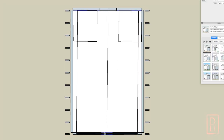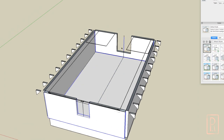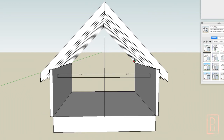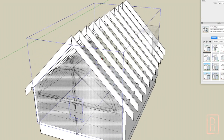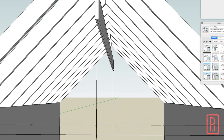You can see the door is here, the window is here — this is a plan view. Here's a line going right through the center of both. You can see that this line is not parallel with the side walls. So this is our reference line. Now let's look at it in 3D — you can see this reference plane extends through the center of the window and the door and is projected up. The next thing we put in is our LVL beam. You can see that the center of our plane goes through the center of the LVL beam. It looks like it's floating but it's attached on both ends with hangers — that's covered in the last video.